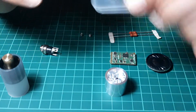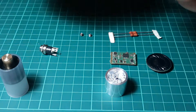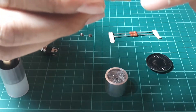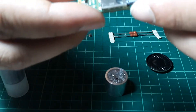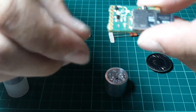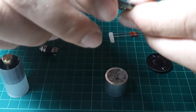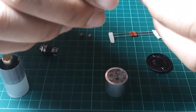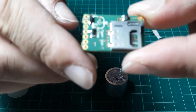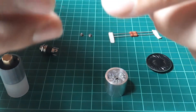The SD card comes with the nano biscotti, preloaded with two fonts — dark side and light side — and version 4 adds a gray Jedi sound set for Rey-style effects. I want to be very emphatic: you should not do any soldering or electrical work with the SD card loaded onto the board. It could short the board, ruin the SD card, and you do not want that to happen. Keep the board empty and unloaded when soldering.